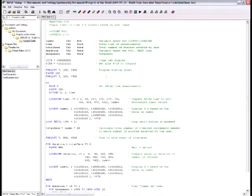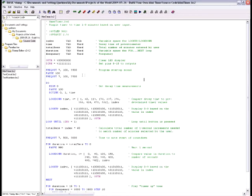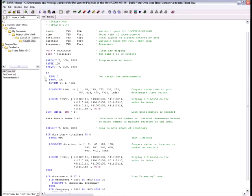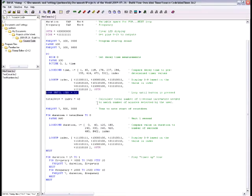Now that we know our circuit is wired correctly and the LED display cycles from 0 to 9, we're ready to complete the final program. First, a tone will play, letting us know the board has been turned on. Then, the program will wait for the user to enter the desired number of minutes and start the timer when the user presses the push button.